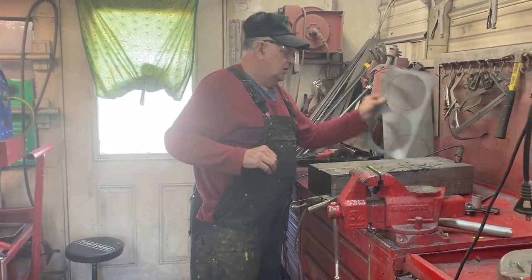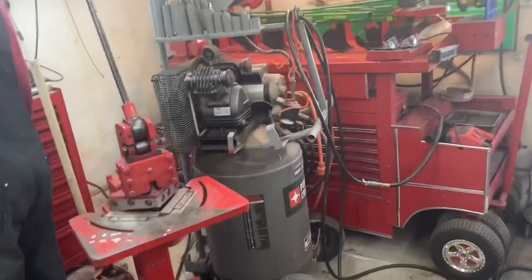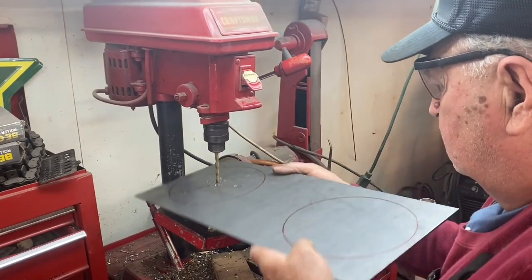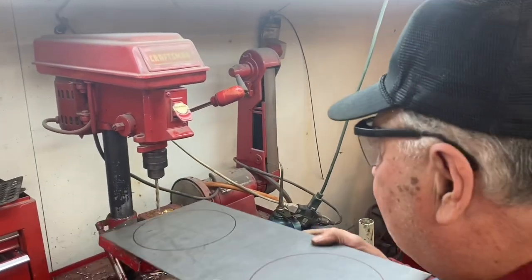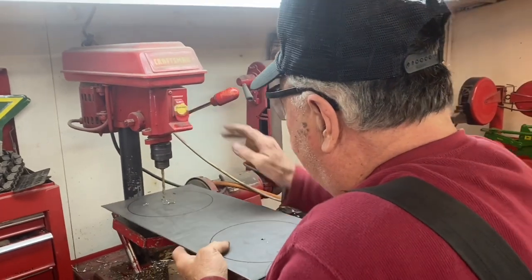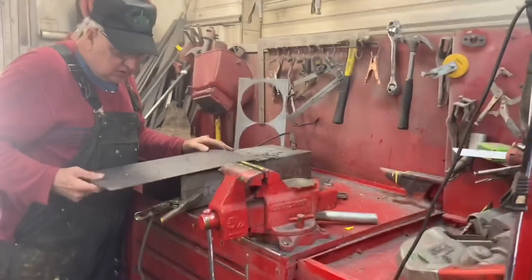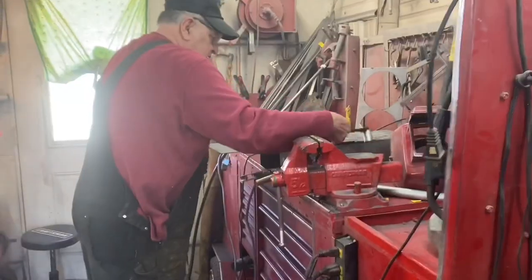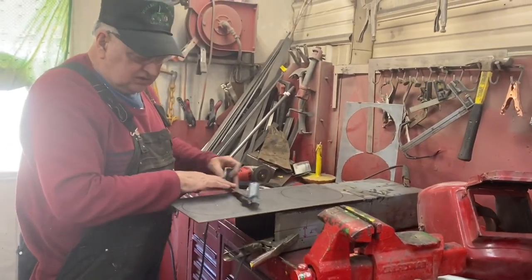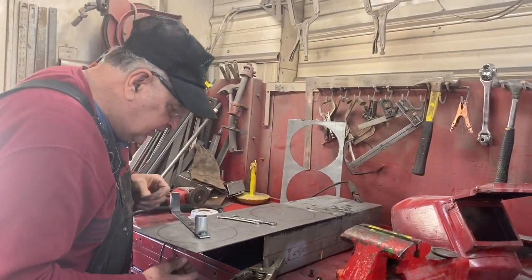These two actually turned out good. Now I have to drill the two middle holes here — quarter inch. There's one, and there's the two holes for the next ones. Bring that out here so there's no overlap. I'm going to tack this on — the reason I tack it is because I don't have a surface to clamp to without it being in the way. If I put clamps here, they'll hit as it spins around. So I just tack weld it on one corner since that ends up being scrap anyway. Now we're going to cut the middle circle out of there.